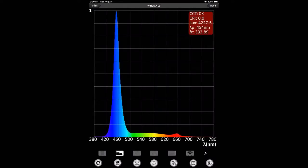So those par numbers that you saw earlier, note that you're not really going to actually achieve those. You're going to be like 35% lower once you turn down the all white channel. The whites all the way down. And we measured that. We'll share that a little bit later. But note that when you turn the thing down to 30%, you turn down performance pretty significantly. All right, so these are the four spectrums after we tuned it to about 30%, and you'll see all the white stuff come way down, which is a combination of green, yellow, orange, and red.